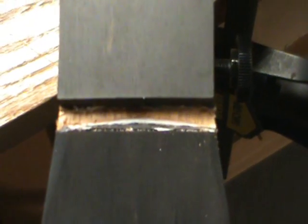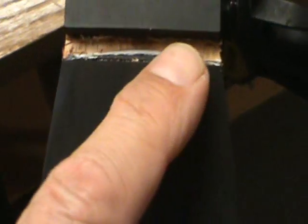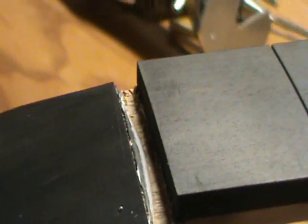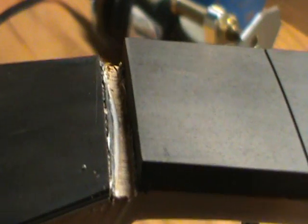Alright, I used that Dremel to take out the bulk of the ebony, you can see here. I'll finish the rest up with a chisel and then a file to true up the bottom. Now obviously we've got the same radius as the fingerboard, because all I did was put a piece of tape on here to protect the fingerboard, and just ran the Dremel across there.